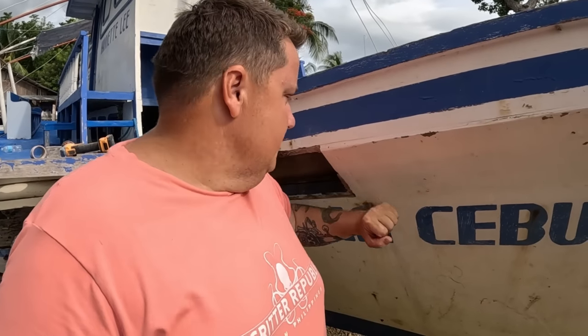Because as soon as we get home, as soon as we cross that water, which will be a crazy video, really scary for us, as soon as we get it over there on the other island, this is all getting ripped off again. All of it, not just the patches. We're gonna reskin this whole boat. We have the skin off, the entire skin, all the plywood. I'm gonna go in there and sand all the old paint, pressure wash the inside, just do everything while it's all open like that. And then I'm gonna recoat the entire structure, the body of this thing, and make it completely sealed from the elements. The wood is already really solid, but it's gonna last forever. And then we'll put the new skin back on. And after that, we're talking about fiber lining it, which is a big job, but I think we gotta do it. So I think he's working on another one right now.